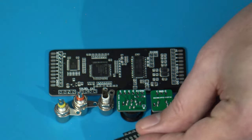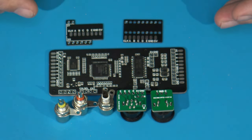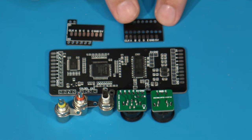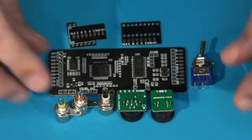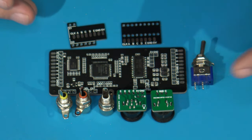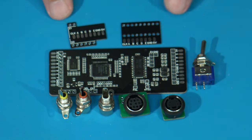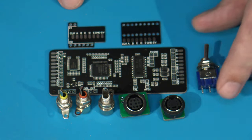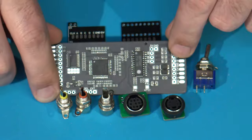It will also come with an 8-pin Mini-DIN panel mount jack, including a breakout PCB for easier solder work, as well as an S-Video panel mount jack and breakout PCB. It will include two additional smaller IC boards called QSBs, or quick solder boards — one designed for use with the stick IC chip, and the other for the U10 color graphics IC chip. It will also have a switch to optionally control the two different palettes programmed onto the RGB board.